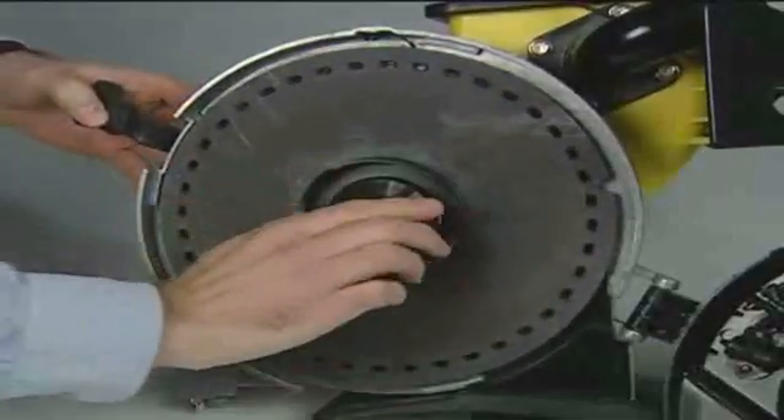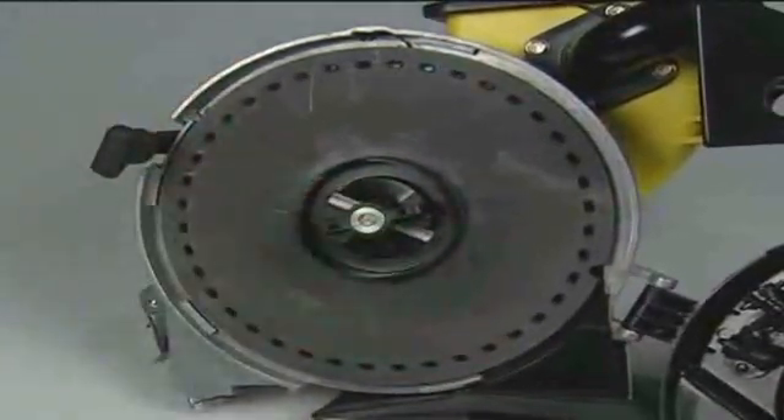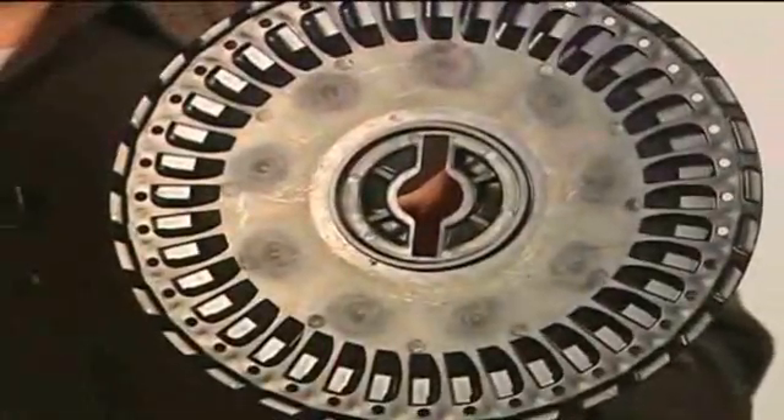The hub area also has an improved disk latching handle, making it easier than ever to change seed disks when changing crops. Seed singulation has also improved with the Promax 40 flat disk. This flat disk system works great for most corn growers, as it handles a variety of seed sizes and shapes, and it's crucial for growers planting irregular or heavily treated seed.